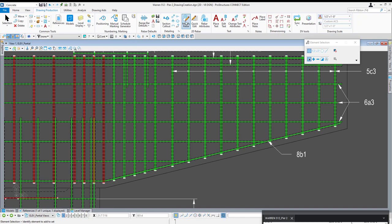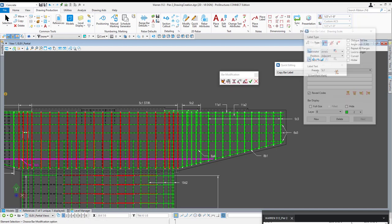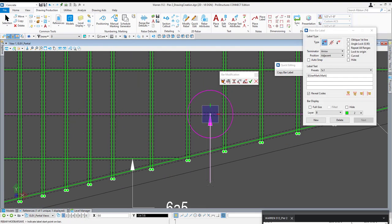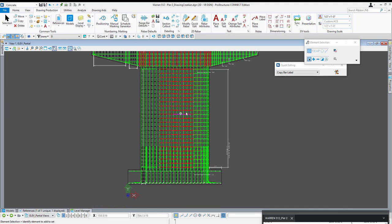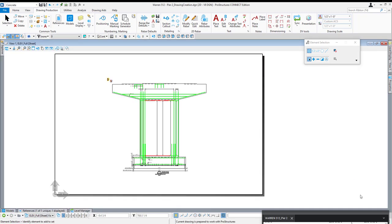My remaining two will be super simple. I'm actually going to use quick edit, copy bar label, select the bar label, select my bars, and go. Now use modify rebar and get this shifted back over here, accept, modify this one, accept. We are ready to continue. So now with all of that set, I'm going to go to my sheet and we're going to arrange these to create our detail. Now that we've placed all the annotations we need, we're ready to begin modifying our sheet and adjusting the presentation to get the appearance we want.